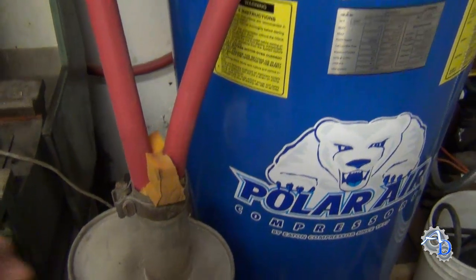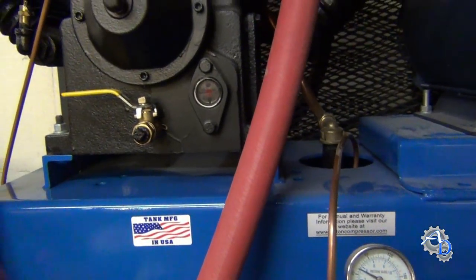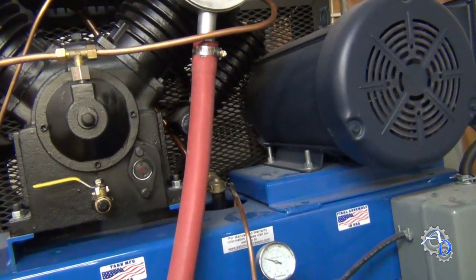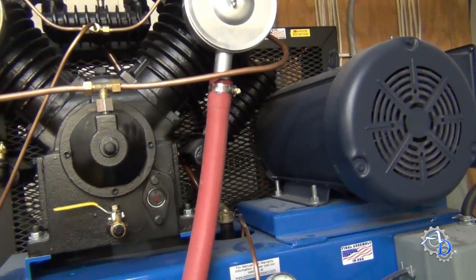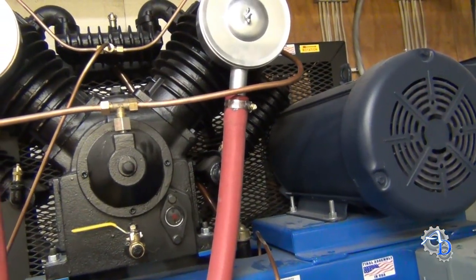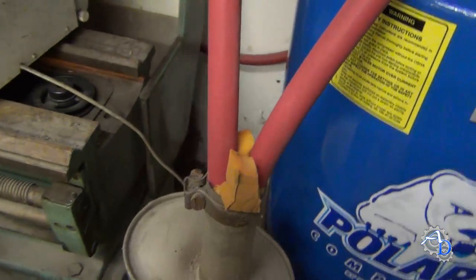The continuous feature on an air compressor is where there's a valve that feeds the compressed air back out through the intakes and down the intake tubes. So it's kind of like the exhaust on an engine — there are pulses of sound coming out of there all the time. Although it's not like a combustion engine, it is relatively loud. These especially help with that because it ducts that air down through into this muffler.